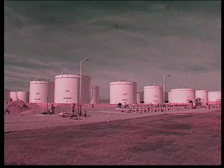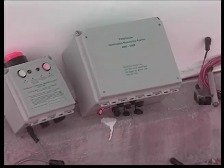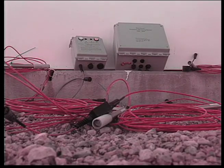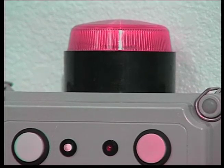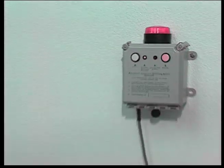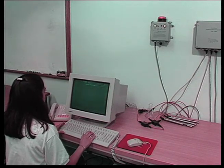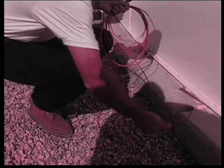FCI Environmental also provides instruments for the continuous monitoring of hydrocarbons: the PetroSense CMS 4000 and the CMS 5000. They consist of a data acquisition and storage module that can be connected with up to 16 probes and an optional alarm module. The CMS 5000 is capable of detecting leaks at rates much less than 0.2 gallons per hour from ASTs and USTs, and is equipped with a modem for remote communications. It can be used for continuous monitoring of leaks from above- and below-ground storage tanks, remediation monitoring, post-remediation monitoring, process controls, bilgewater monitoring, and stormwater monitoring.